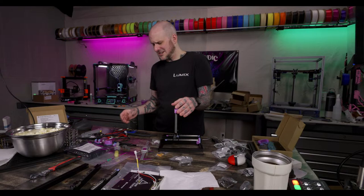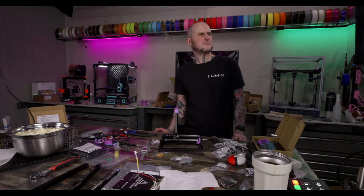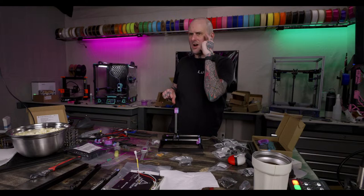Honestly, my favorite on the Ender 3 is the... What's it called? I'm blanking. What's the Ender 3 tool head that everybody uses? It's all configurable. I was reaching to build a Micron and just couldn't reach high enough for the Trident. Hero Me. That's what I'm thinking of. Hero Me Gen 6, or I think it's on Gen 7 now. Yeah, I really like Hero Me. That's what I run on my original Ender 3. I have a Hero Me with a Revo CR in it, a pair of 5015 part cooling fans. It's great.